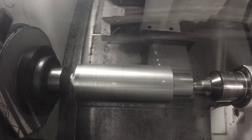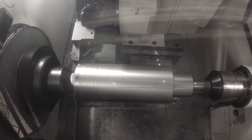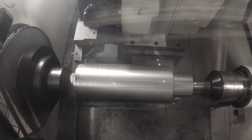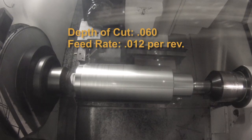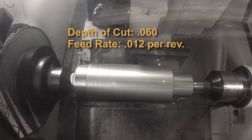Other than the initial cut, you can machine both toward and away from the driver, which can save time on certain operations. Less aggressive cuts are needed when moving away from the driver to prevent possible unseating of the drive pins.